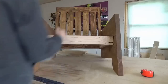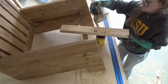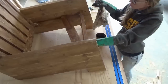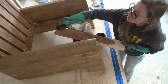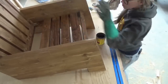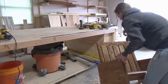Once this was done, the last thing remaining were the seat slats. Before adding those, I went ahead and stained the apron and the runners, then added 2x4 seat slats, staining as I went. It's a lot easier to stain things before everything's assembled — I know this from experience. For the seat slats, I just eyeballed the spacing and then screwed them in place.